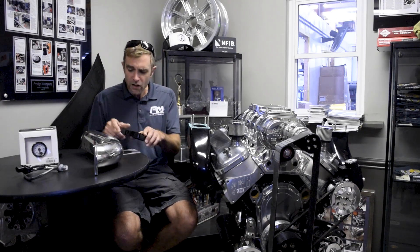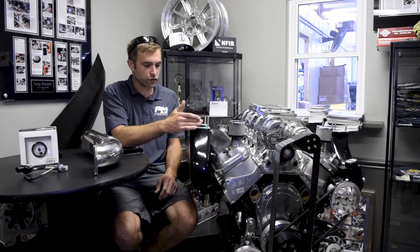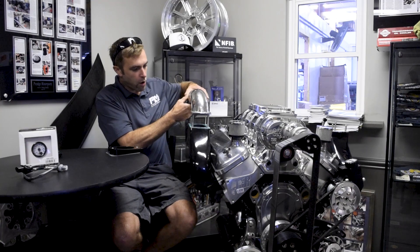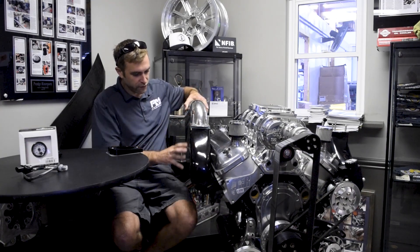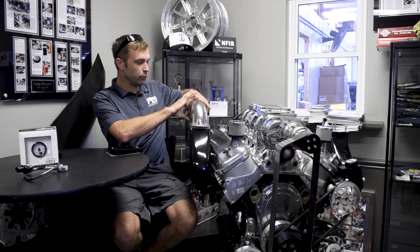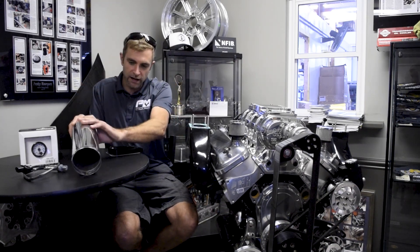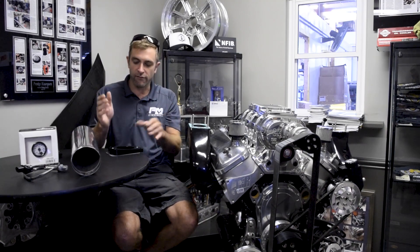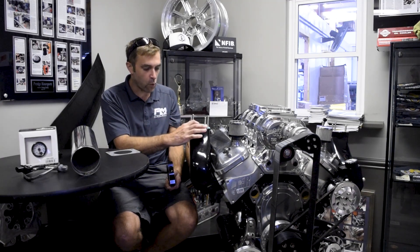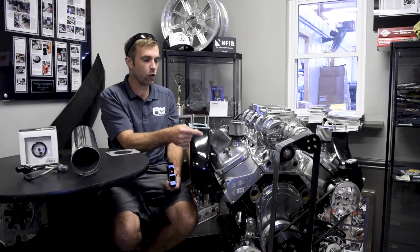On this manifold and tailpipe application, it's actually what they call a wet joint — water basically flows around this manifold and there's a passage in here that brings it up into this two-piece tailpipe. The reason I mention that is to point out that we always go the next level. These O2 plates were designed for a dry joint, not a wet joint. A dry joint would have no water crossing through here — there'd be an external hose that would connect it to the tailpipe.